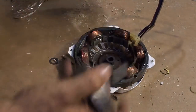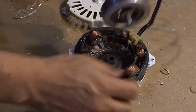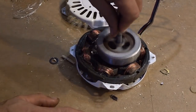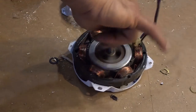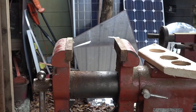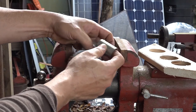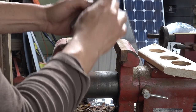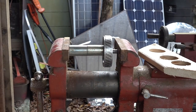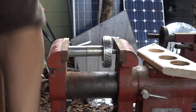Pull the cover off. Once you pull the cover off, you will have the squirrel cage rotor. This is part of an induction motor, so if you just spin a regular motor it will not produce any electricity — a little bit, but you have to get it excited. This is a regular vise. These are like a conduit — you can use PVC if you want. What you want to do is put both of them on the backside of this and press it off. It was pressed on, so it should press off. You may need an extra piece of pipe for your vise to give you leverage.